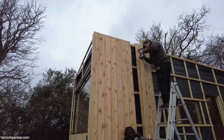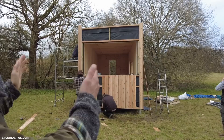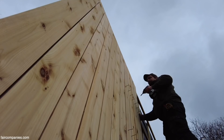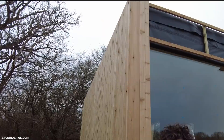There's some real progress here — the cladding is coming on. This is Western Red Cedar; it's British. In order to set it out, we've worked out the total width of the building and divided it by the number of boards, adjusting the spacing accordingly to make sure it's the right width. In each board there are two screws for every batten, and we're using stainless steel decking screws because they've got a special little head. You can get them out easily again if we ever need to make repairs — they've got a Torx connection so you can get them out even though they're that small.